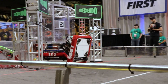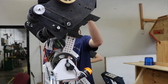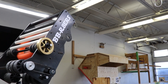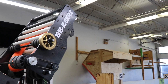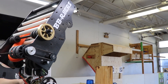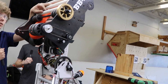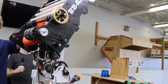One last thing we're looking to add for Rocket City is a trap mechanism. What we've been trying is inverting our shooter and feeding the note out through our feeder, which allows us to get more height and more accuracy when shooting into the trap than teams shooting from their normal shooting position. One thing we want to add, based on inspiration from Windham Windup and 4028, is a leaf blower type mechanism that will strap to the side of our shooter and blow the trap open. Since our feeder wheels don't necessarily have enough force to push open the trap by itself, that should allow the note to settle in on its own. That's an addition we're looking to add in the next couple of days.